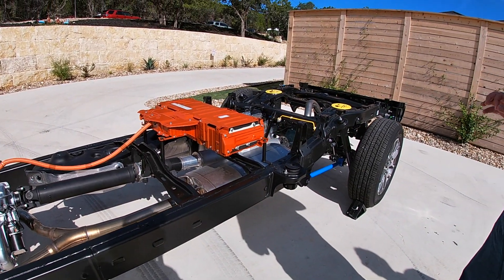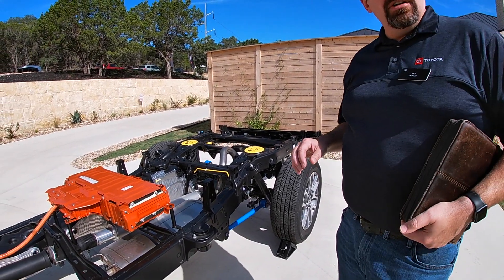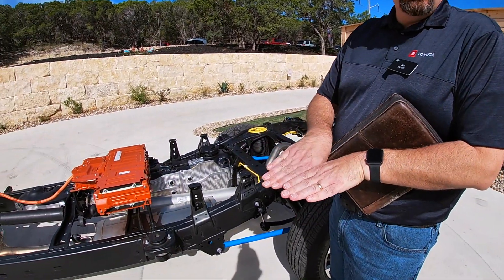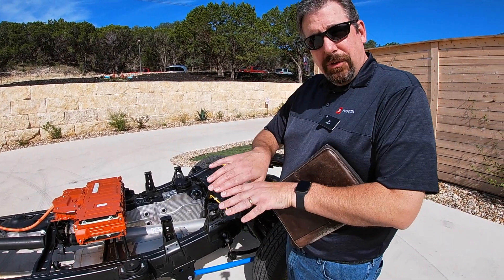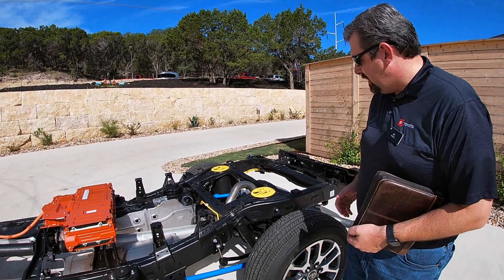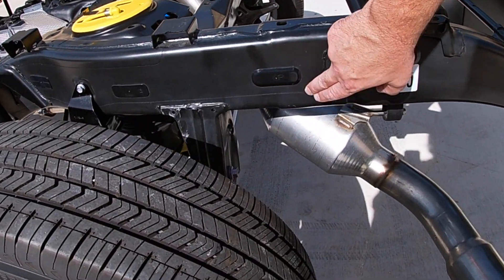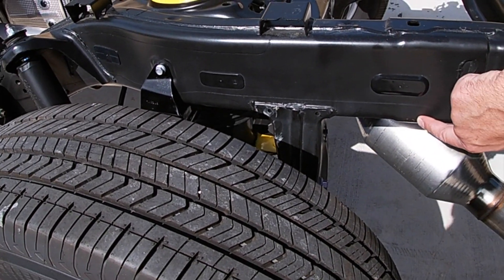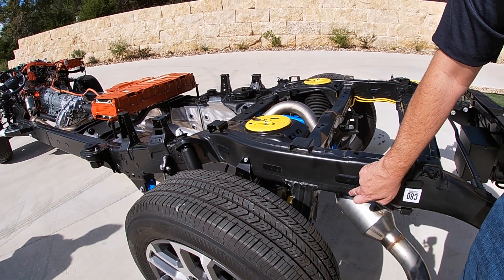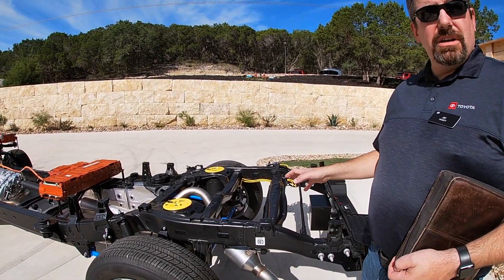The only place you may find some double lap is when you get the sections welded together. The really impressive laser welded blanks that we're using are what we call non-linear laser blanks. Typically you have a straight piece of sheet metal butted up against another straight piece and welded together, but when you fold and bend it you get wasted material in some locations. With this new process, a higher strength thicker material is cut into the base material and laser welded together, so we put our mass where it needs to be for the performance of the frame.